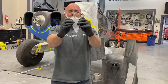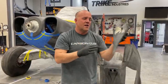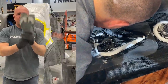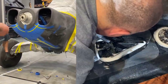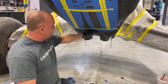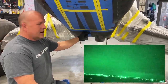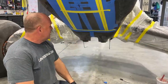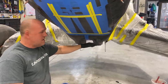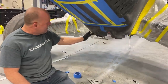After I bond this in, I'll lay up carbon right over that fill and onto the removable belly pod. NACA is done. And then the other thing I've got right down here by the exhaust — this is my night vision camera. I tipped this angle just to match the exit air of my exhaust pipes, and also to put in my night vision camera here, pointed at the correct angle for all around forward and down view. My exhaust pipes are set back with a big air reveal around it. The slopes I have here are to accelerate the air that comes over — it catches the exit air of the exhaust and will create a big vacuum and suck air out of the cowling.